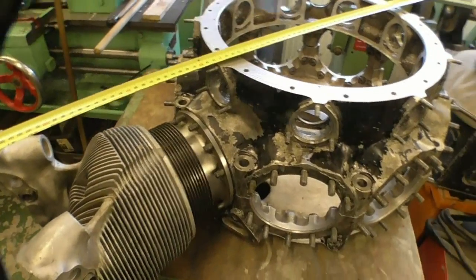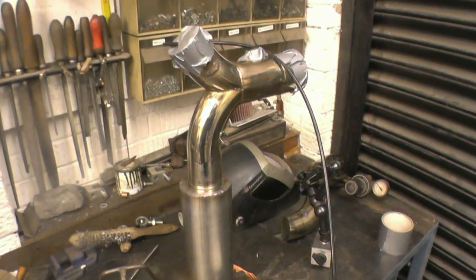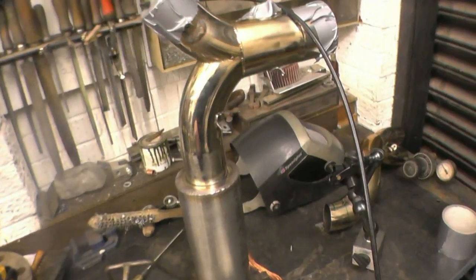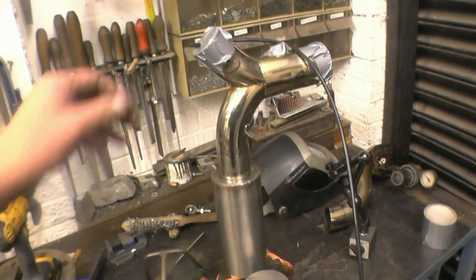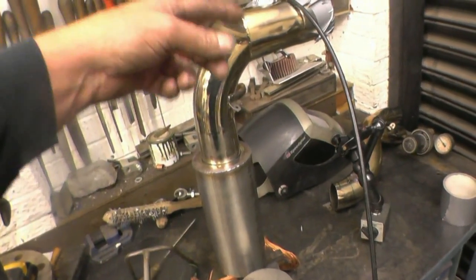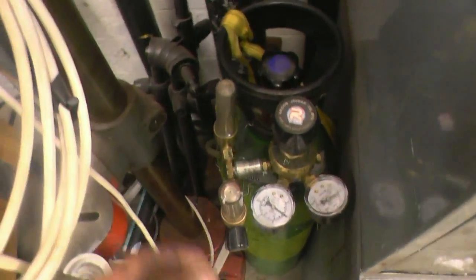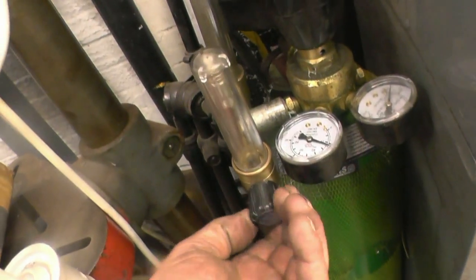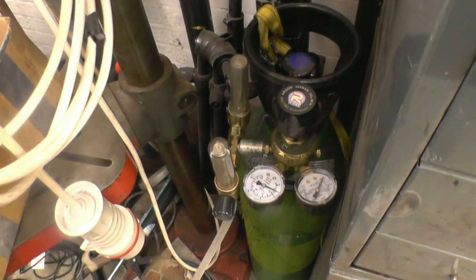It's going to take some pretty good bolts to keep it up there - it should look good. This is not the sort of work I normally get involved in - it's some stainless steel pipework off a motorcycle for a friend of a friend. I've been doing some welding on it and need to weld the ends. This pipe here has a separate argon line - you need to put an argon purge inside the pipe. If you don't, you get what they call dingleberries. You can see my argon bottle here - I've got two flow meters, one for the torch and one that supplies argon flow into the tube.